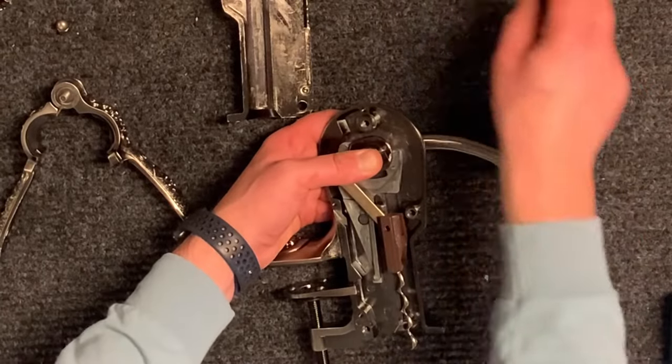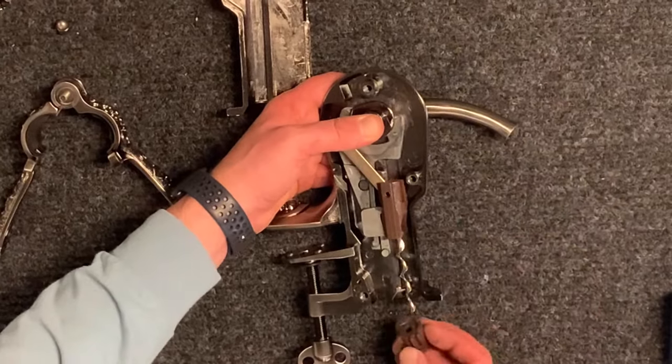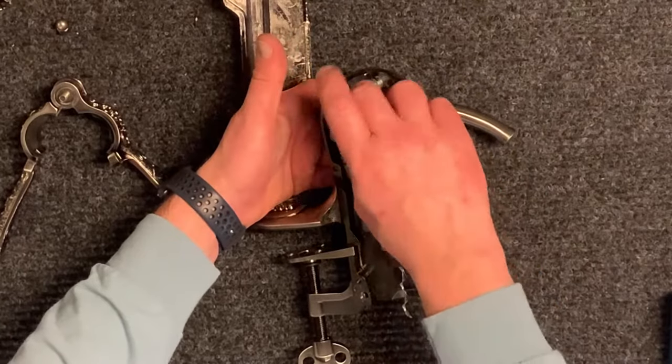The dog will slide along the cam and hook onto the top of the drive slug. Slide the guide slug up the auger and fit the post on the dog into the hole on the guide slug. Place the small bushing on top of the arm.